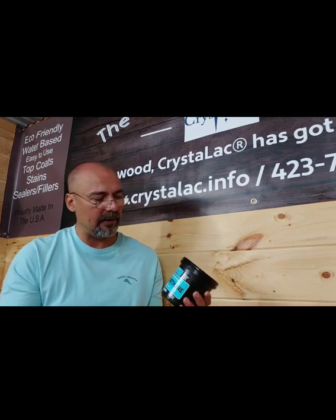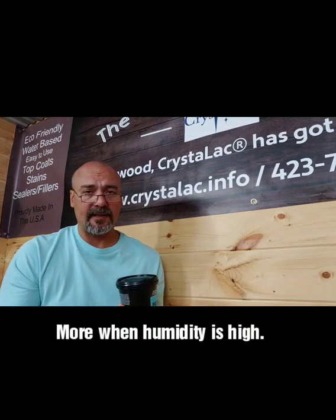Read your manufacturer's recommendations. I know here at the CrystaLac Company with products like our Extreme Protection Polyurethane, we recommend a minimum of 2 hours dry time. And that's before you can recoat or scuff sand if, for example, you have grain raise after that first coat or something like that. But give it 2 hours minimum.